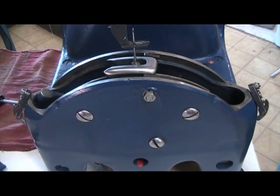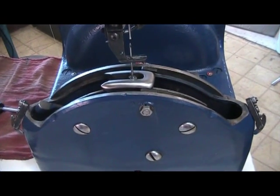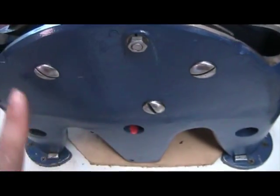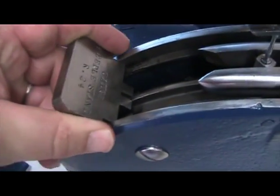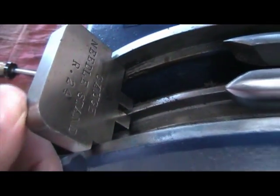After you change the needle and verify that it's okay, we can go on and check the alignment of the awl and needle. Before we move to the awl alignment, we need to verify the needle is in the proper position. We have a fixture that we use when setting the machines, and this is used unless you're changing out the needle bar stand or you've loosened the needle bar stand assembly and the bushings inside. If you change any of that, you have to reset your needle bar stand. This fixture makes sure that the race of that needle bar stand is right in the middle of the frame.